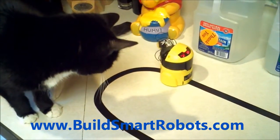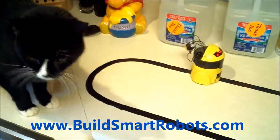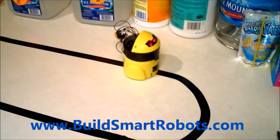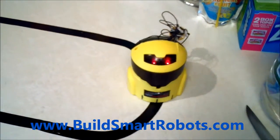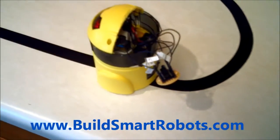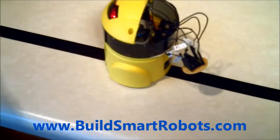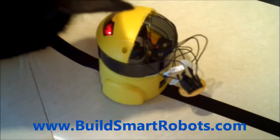We're coming right back. So as you can see, another great thing about the TI LaunchPad is it does actually flash the part. And the MSP430 is such a great part for DIYers. All I had to do was put a capacitor and a resistor on there, and you can basically dead bug the part onto your project. It runs directly from two AA batteries. The cap I have on there would probably run that MSP430 for a day, but it was just the only thing I had — you can use a much smaller cap.